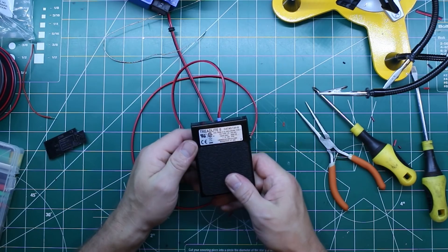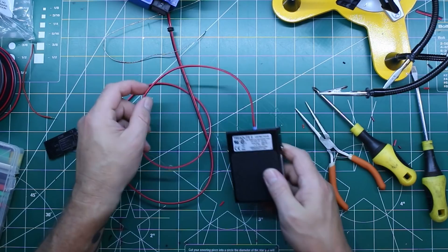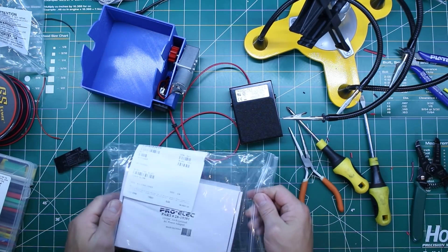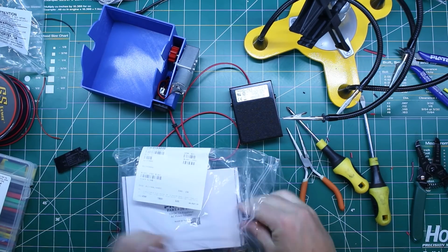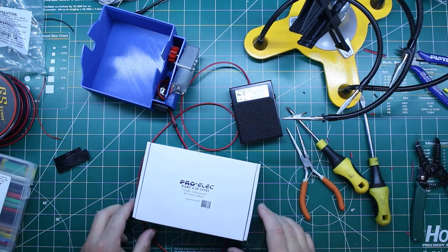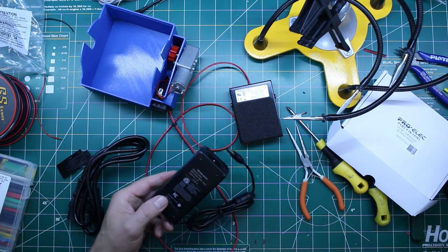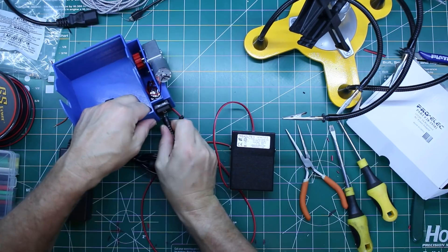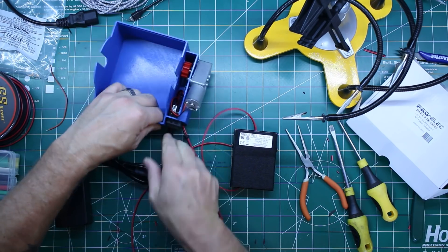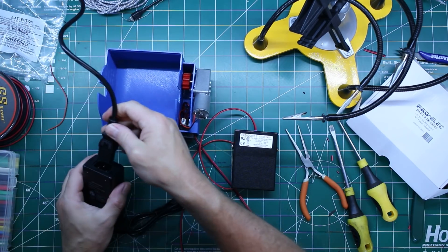The foot switch is a Line Master — it's really nice. I had to open it up to get to the contacts. It's got a piece of metal bent over a little micro switch on top and when you push down on it, it drags this forward and pushes the button — that's pretty cool. We have normally closed and normally open — we want normally open because when we hit the switch it will close the circuit. Got the strain relief on there. I can hear the switch engaging so I put that together right. The power supply for this is a 12V ProElec 3-amp supply — a little overpowered but it'll do just fine.